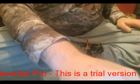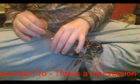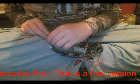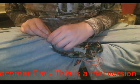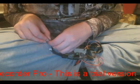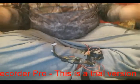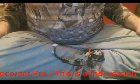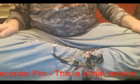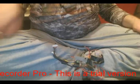Then if you take this one out, put a PNP where it's supposed to be an NPN, watch. Hang on. Okay, and I'll put a different, opposite transistor into the opposite socket. That's for the opposite type. And we got none of the LEDs lit up or flickering. That's because it's acting like a diode in reverse bias. Or you could say that when it's in the opposite direction, current can't flow.